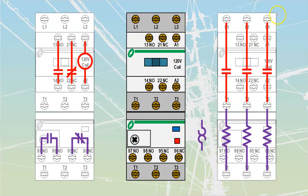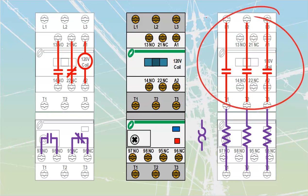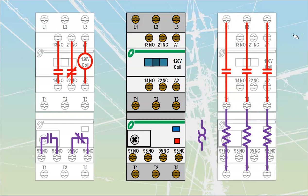On the right-hand side, the red circuit up top contains all of my motor contacts. The motor contacts are a normally open component that will close when we want to activate this thing and send power through to the motor. The purple set at the bottom is drawn as resistors. The proper symbol for what's inside is the double shepherd's hook — that is our symbol for an overload. The problem with that symbol is it gets misinterpreted; many electricians assume the overload will open up in between and separate the circuit.